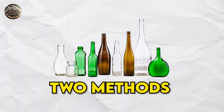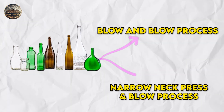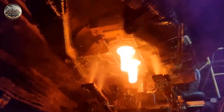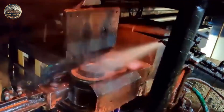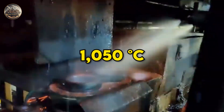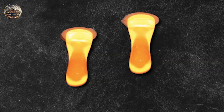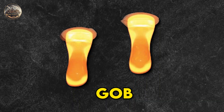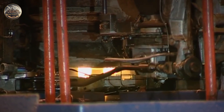Manufacturing of glass bottles is done by two methods: the blow and blow process, and the narrow neck press and blow process. Both processes involve cutting a stream of molten glass with a cutting blade at a temperature of about 1,050 to 1,200 degrees Celsius to form a rigid glass cylinder commonly referred to as a gob. The gob is of predetermined weight, sufficient for manufacturing one glass bottle.